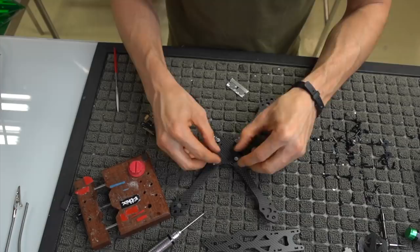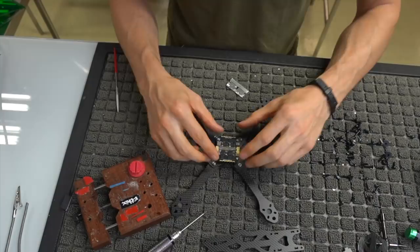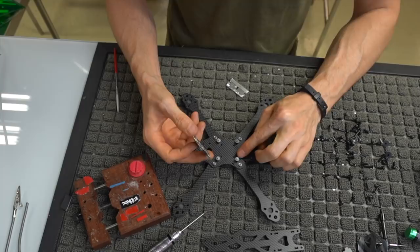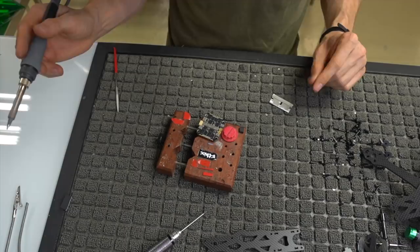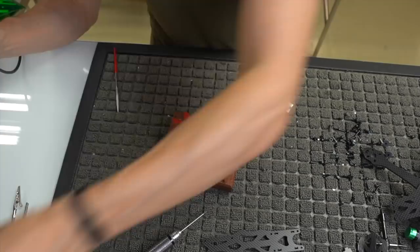They're actually really soft. It's not anything specifically for soft mounting the flight controller or ESC. It's mainly to just put a little bit of a buffer between the ESC and all of this solid mounted stuff. So put those little donuts on. I'm going to tin the ESC up, and then we'll go ahead and install that, because there's not really anything else to do other than to tin it up. And yeah, let's go ahead and do that.